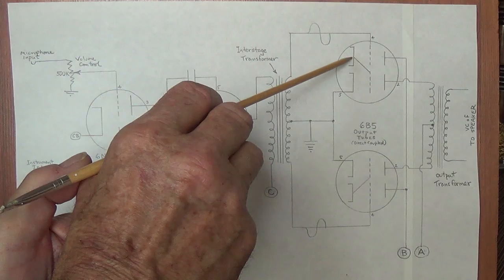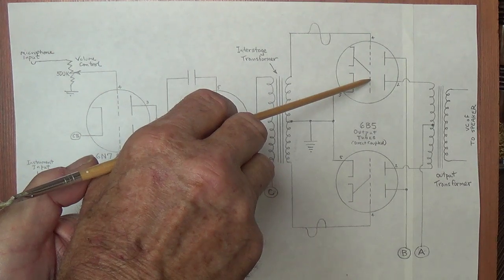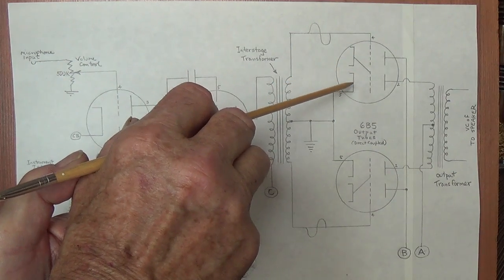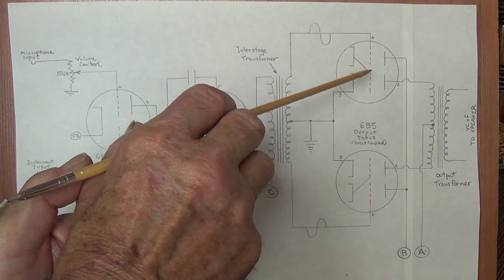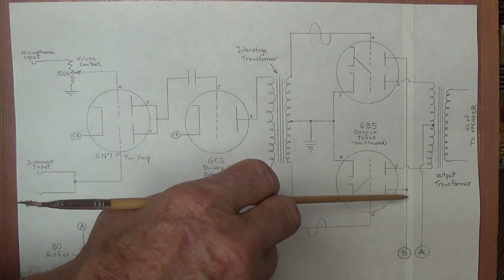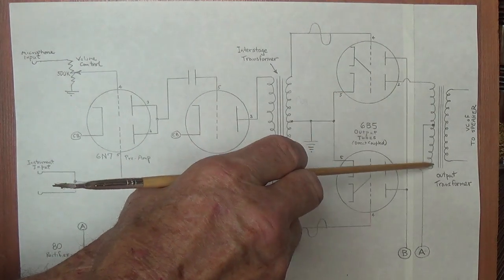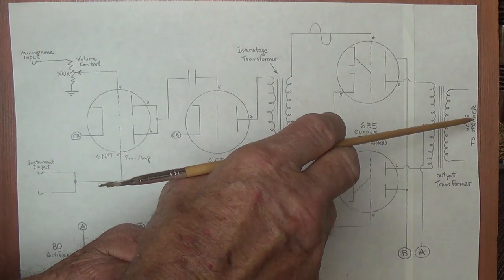Now imagine if you took the signal on the cathode, which is quite large, and sent it over here to this grid. Do you see then that there's internal amplification that takes place? It's almost like a built-in extra stage of amplification that takes place within the tube. So from one tube, it's like you get double output. That's simplified, and that's the way I want to leave it because it's not the issue here really. Now we see that the output from the plate of each of the second triodes goes to a regular output transformer, and then from the secondary of that output transformer onto the speaker.